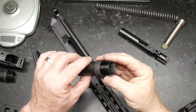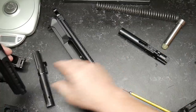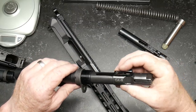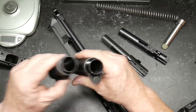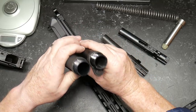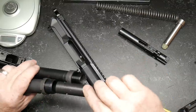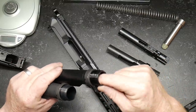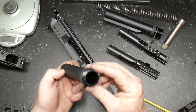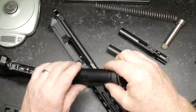One of the things I wanted to do was take that buffer out just to see what's going on, because there's an enormous amount of wear and I'm not sure if it's the buffer or what. You can see that damage is matched up right there. I'm going to take and put a new buffer tube on. We're going to run a couple hundred rounds through this thing and then test to show what the differences are at the end of the day. If that continues to cause problems, I'll know something's up. I'm going to run this new buffer tube on this lower and see if that makes a difference.